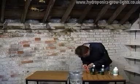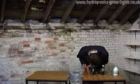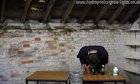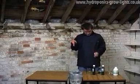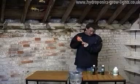So we'd put the little screwdriver in the back, give it a little twist one way. I've gone too far that way, so then I'll go back a little bit the other way. A little bit of fine adjustment back and forth till we get to a pH level of 7. Now that meter is perfectly calibrated to pH 7, so we know it's true. That's how you pH calibrate.